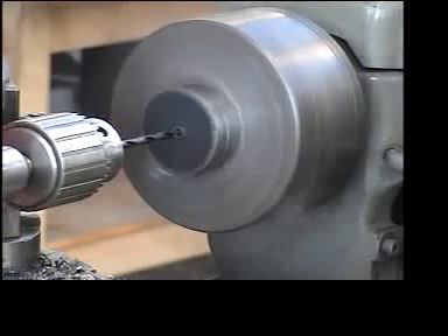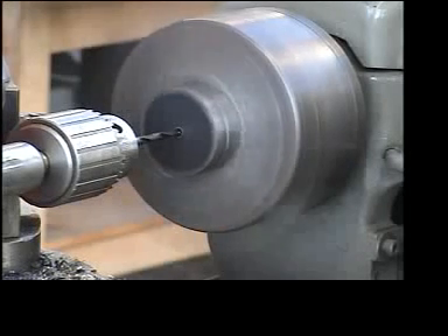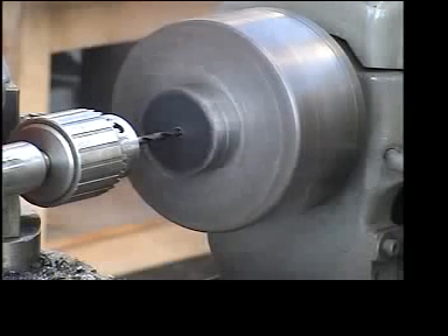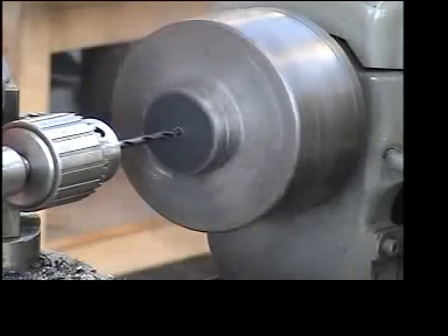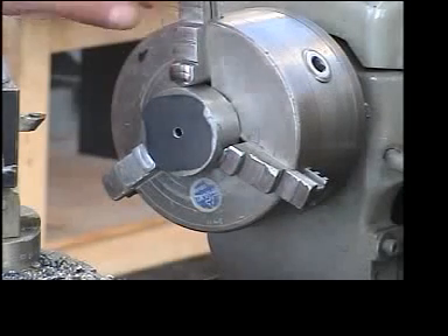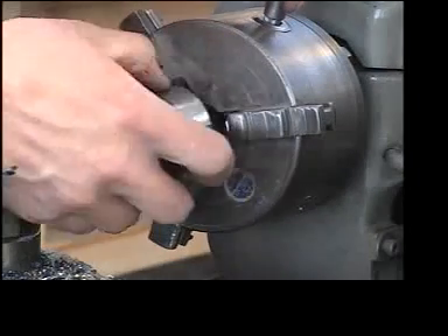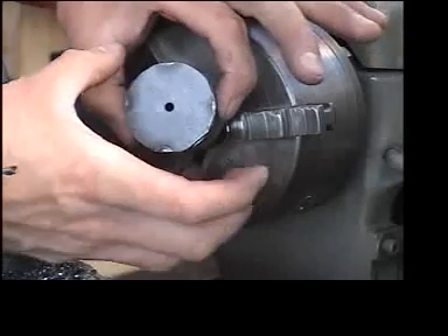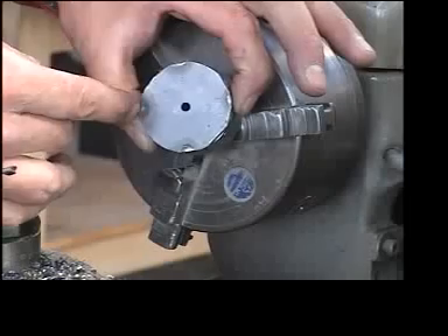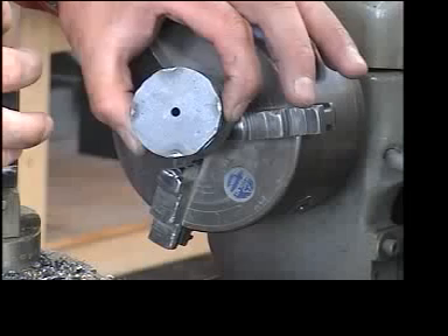Now it's gone through the first side. I'm going to advance the drill until it comes to the next side — starting to drill through the other half of the wheel. I can feel it getting easier to go, which means I'm through the other side. I'm going to wind it back, turn the machine off, slide the tailstock back. The hole looks good on this side; I'll take it out of the chuck and check the other side — there we go. We have a perfect hole, and the advantage is that it's now concentric, meaning the hole is in the center relative to the outside of the wheel, so when it rotates it won't wobble.